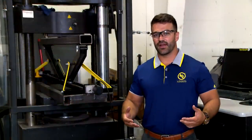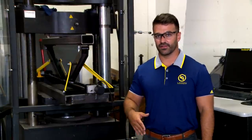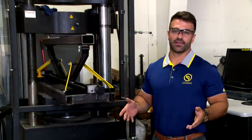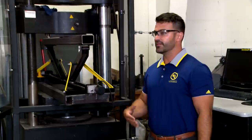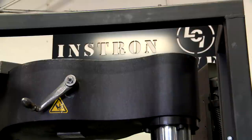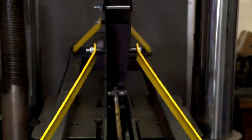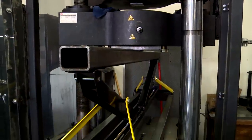After seeing some common misuse, we know that these jacks will break under excessive load. As I've stated before, we're only stabilizing here — so you're talking about 1500 to 1700 pounds. Typically at failure you're going to see double that. How do we get to double? Well, right behind me is an Instron machine. What this machine does is we run the jacks up, place a crossbar across them, and then it'll actually crush to whatever load we're setting it at. So as warranty claims come in, we know from our own internal testing exactly where these failure points are and probably what happened in the field.